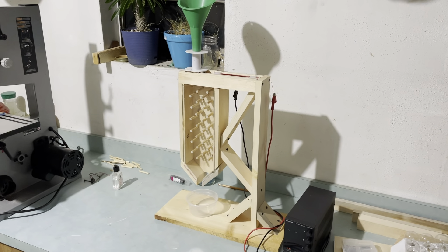There's the electromagnetic piston, which is basically a wide straw that's wrapped with magnet wire. I think I got about 1,100 turns on there. When you run current through that, it creates a magnetic field, which causes an iron nail to be attracted and suck towards the middle, pulling the piston, which is filled with food. It'll pull it open and the food will drop down that hole, down the plinko, and back into the food dish.